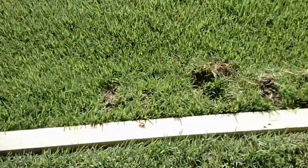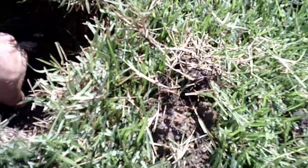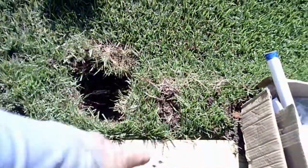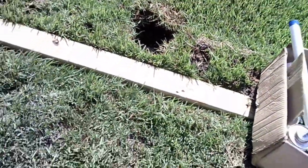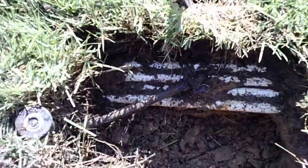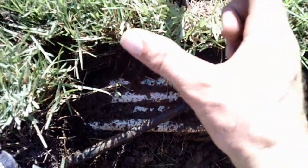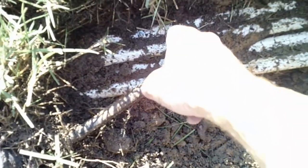Now I get to move down to the last post we need to set, which is probably the most fun. The sprinkler system pipes for our customer are right in the way of where this post needs to go, so we get to do a little plumbing work. I'm going to dig out a big hole and get the plumbing situated. Can y'all tell what the problem is? The post goes right here. This closest pipe I'll be able to leave, but those other three I've got to cut and splice around to go around the post so we can dig down there.